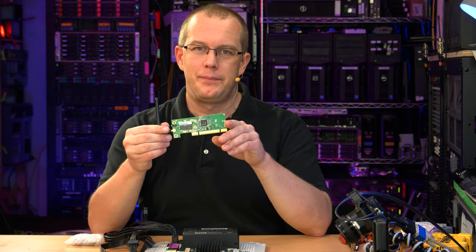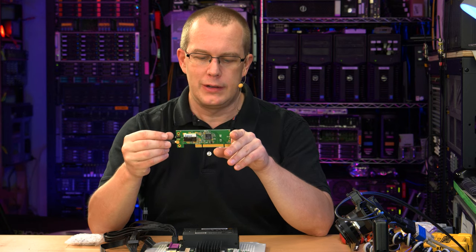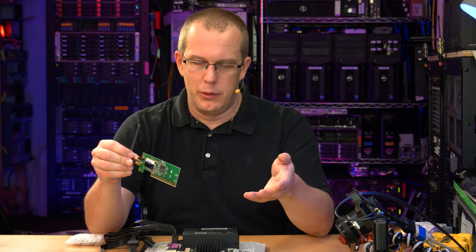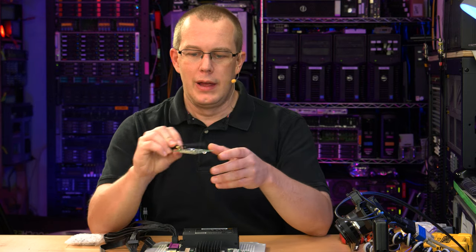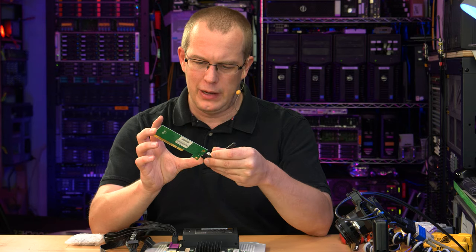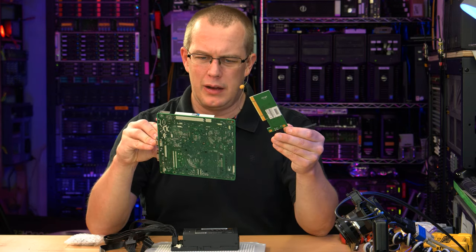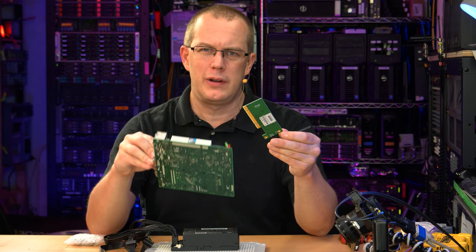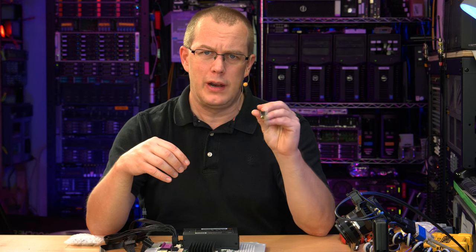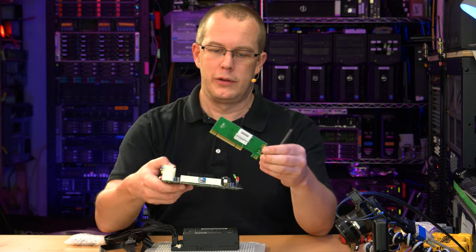As for this wireless card, this is really more of a demonstration piece than anything, because when I plug this into the board, it won't boot. Like, it won't even post. And I think that might be because this card is so old, it might be 5 volt PCI, and this thing's like 3.3 volt PCI. I'm pretty sure that's a thing. I could be talking out my ass, but anyway, this card could just be faulty. There could be something shorted inside of it. But just to demonstrate, I have another one on order that should work with this board.